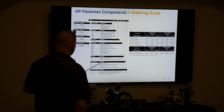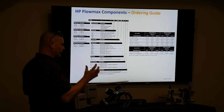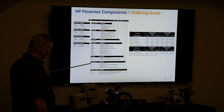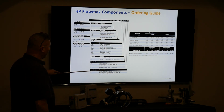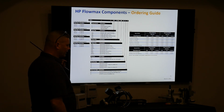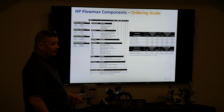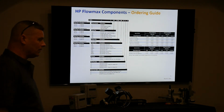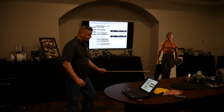And then a restrictor, which is unusual for us, but you'll have the restrictor, which is on the downstream side of that block of the pilot. And then the type of mounting, typically the side mount is pilot front of valve. And then what sense line option you want. The standard is A with a 1/2-inch NPT common sense. If you want, you can get 1/4-inch NPT, but with the size of that valve and the amount it's going to flow, I think that's why their standard is 1/2-inch.